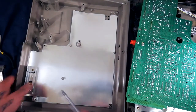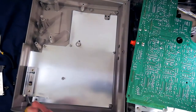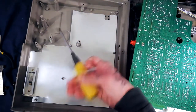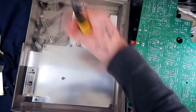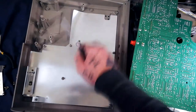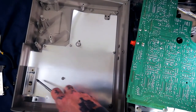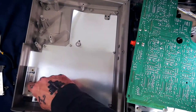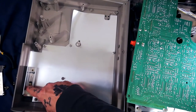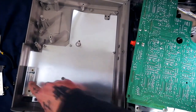Since I've already detached the cable from the transistor, there's no real reason to detach the heat sink plate. You might need to if someone spilled liquid and you needed a deep clean — then you'd remove it from the two mounting posts and could use double-sided carpet tape to reattach it. If you do need to remove or replace the transistor, remember you'll need thermal compound of the type used to attach a heat sink to a CPU.